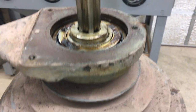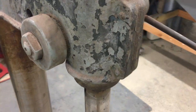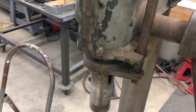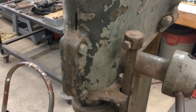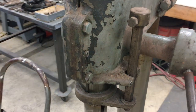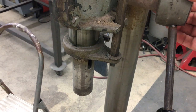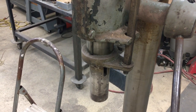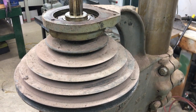So I think the next step is to take this off and see — if you turn this down, the spindle comes out; you can see it going down in the top here. I think we take the depth stop off and maybe the spring, and just turn this all the way out. Get that out, look at the other bearing, and I think we're going to be in really just clean-up and lubricate mode on this. It really looks good.